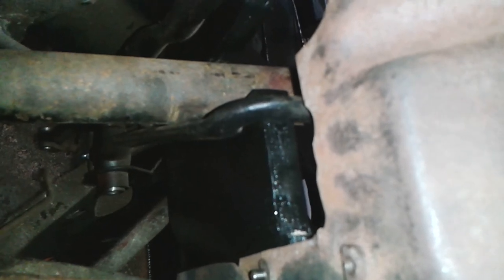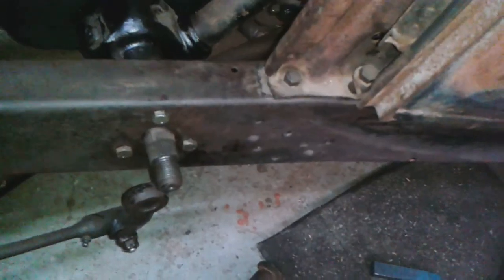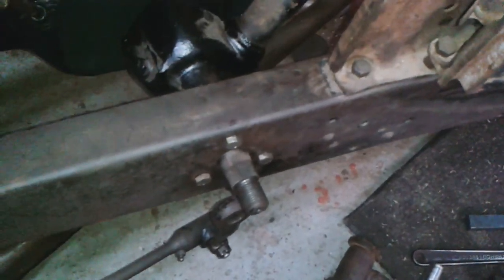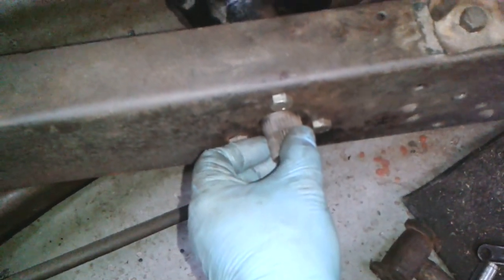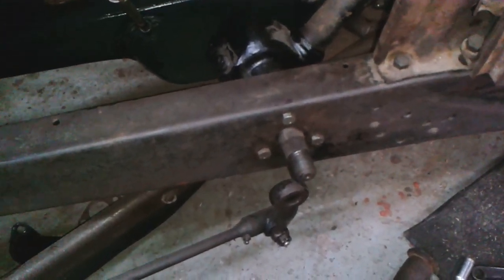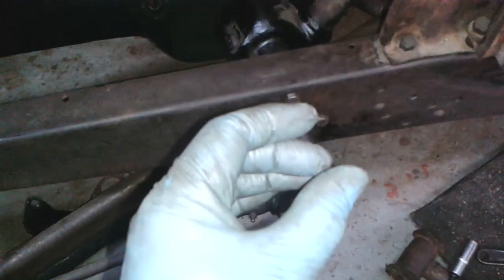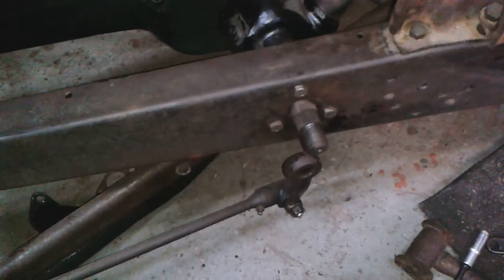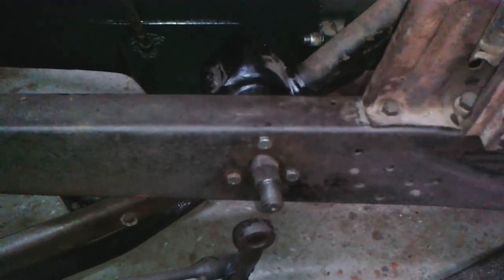So what I think I'm going to do is put some extra shims in here to move the whole thing that way a little bit. I'm going to try that and see if I'm happy with it. Then when it's done I might actually turn some little spacers rather than having a stack of washers - use the washers to get the height, then measure the height and go and make some. I'll carry on then and bring you back when there's more to show.